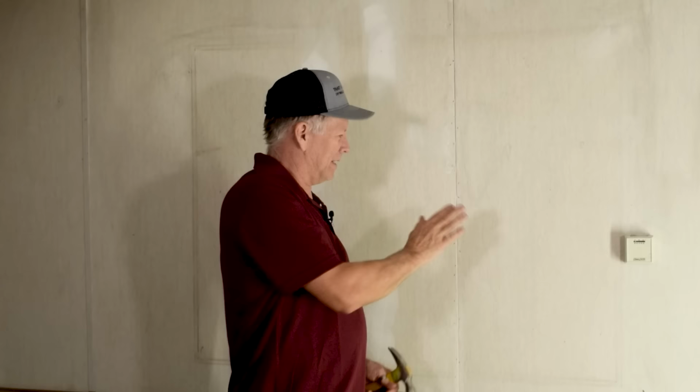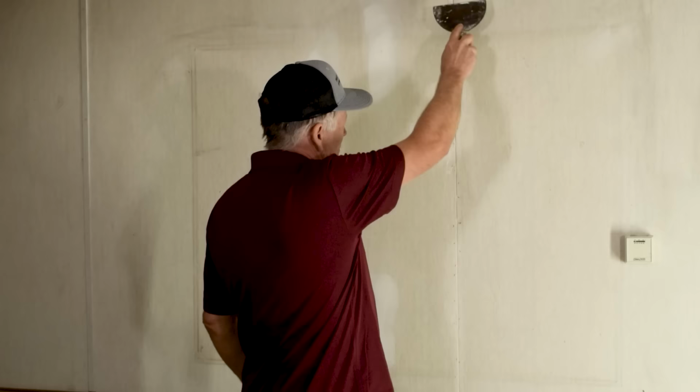So you're going to end up putting it on about a 16th of an inch. And that's quite a bit of mud, actually, and there's just no point in it. So just go ahead and drive them all smooth. Then the next step is to check for tightness.